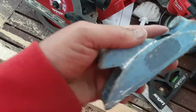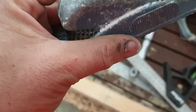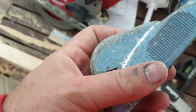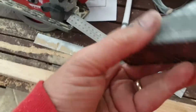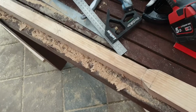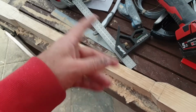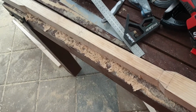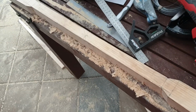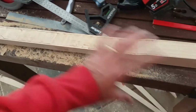with one of these doohickeys. I think they call it surf form, something like that. Anyway, I don't know what it's called, but apparently they use that. I haven't used it yet. I had it lying around. I'm going to have to use, obviously, the sander once I get going, but I'll electric plane that and get that loom down, and then I'm going to start rounding it out.